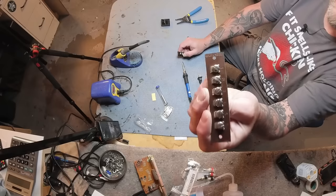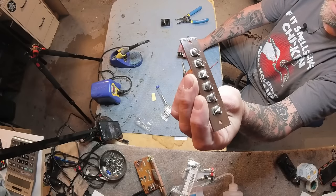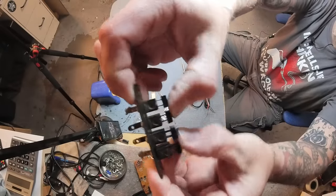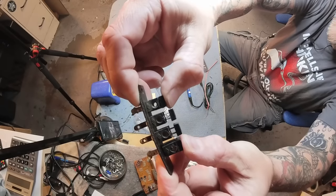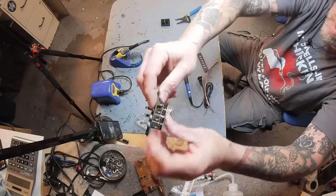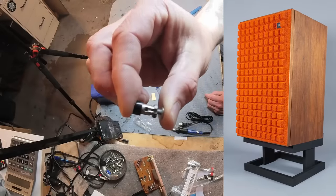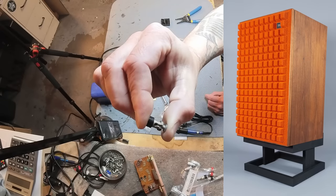A lot of people would agree that tinning is better than any connector you can buy — it gives you more contact connection, which is always good with your precious electronics. I've got a couple different styles of terminals: the screw down style common on the back of tube amplifiers, and then these are the speaker jacks for a Marantz 22 series — 2270, 2245 — with a pretty small opening. A JBL, like off an L100, has a tiny opening too; there's no way you could get 10 gauge speaker cable in there.